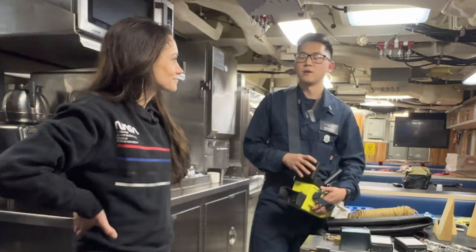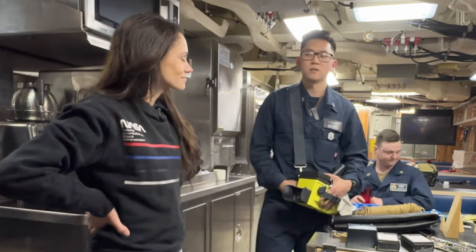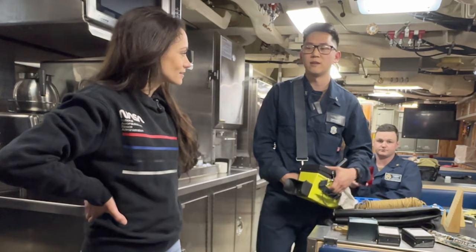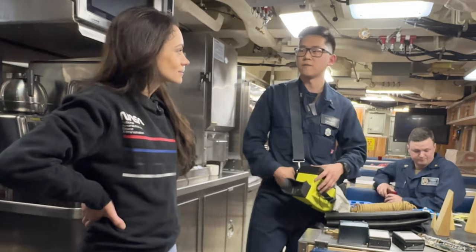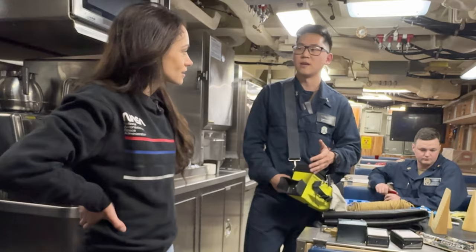It's combustible metals, so magnesium. There are a few spots on board that we have combustible metals, but in that situation, it's essentially keeping all the components around it cool. Okay, and you still use water? In that situation we will essentially flood whatever that component is. Again, you're not really putting out the fire itself, because water would cause oxidizing, which, as you can imagine, is not great. So essentially we're flooding it, keeping everything around it cool so the fire does not spread as a class alpha.